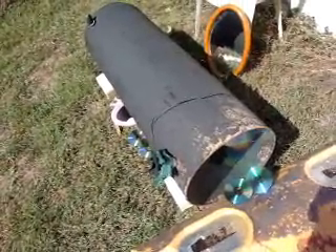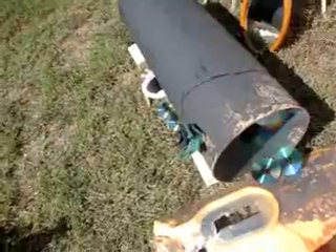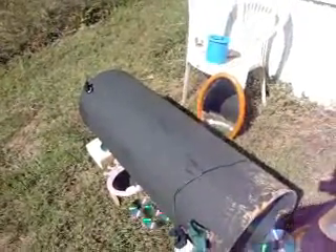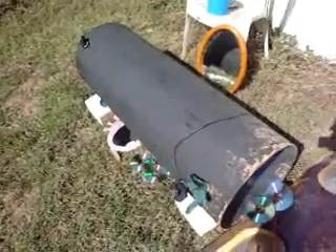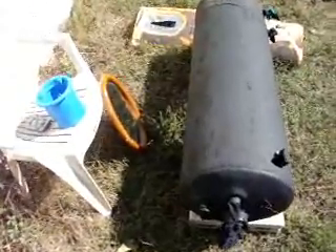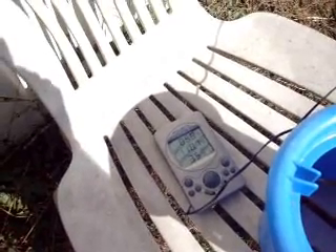Right now I'm doing a basic temperature test — there's no water in this unit, just testing the air temperature on the inside. I can't use this tank; I got it completely stripped and painted, then pressurized it and found a bad leak along the welded seam. I've got CDs laid out for reflection, my kid's little princess mirror underneath, and another mirror on the other side. Any holes are plugged up to keep circulation down. Right now I've got 110.7 degrees on the inside of the tank and 85.8 on the outside.